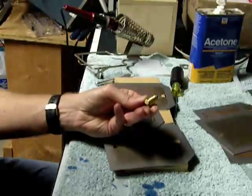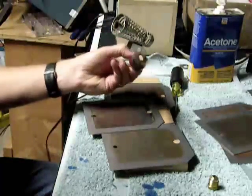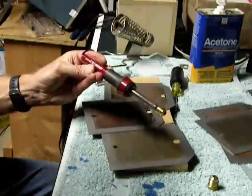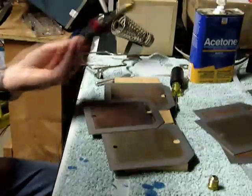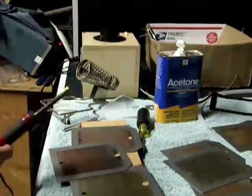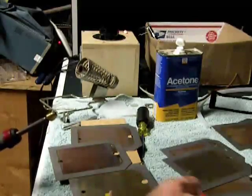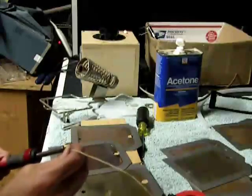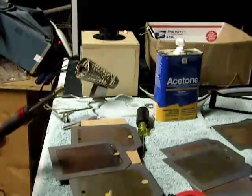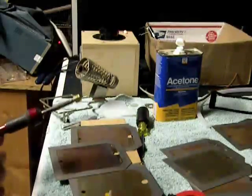You might recognize this — it's a compression fitting, a two-ended nipple. I've cut it off and put it on the end. This is a soldering iron used for stained glass — it's pretty heavy duty, but I've hooked it up to my variac. I've set the temperature using this handy dandy thermometer, and it turns out that this plastic melts around 150 degrees Fahrenheit.